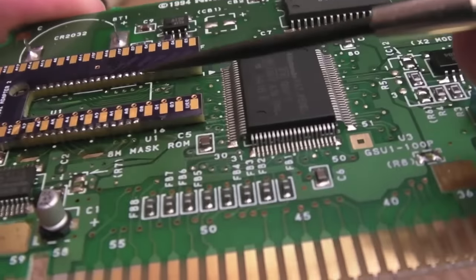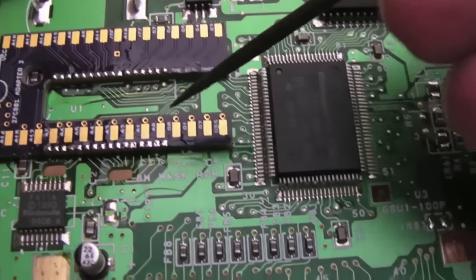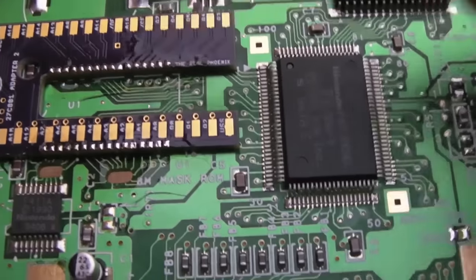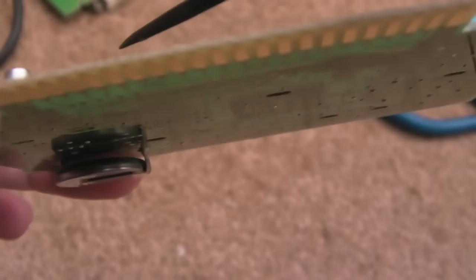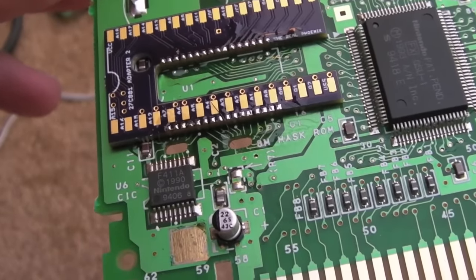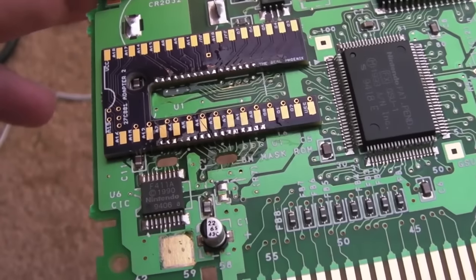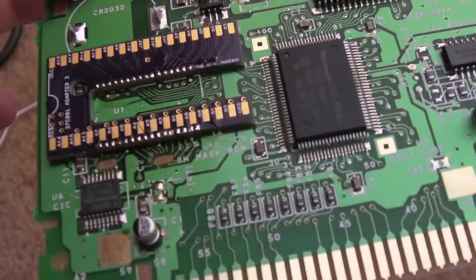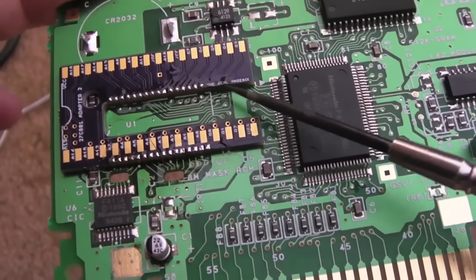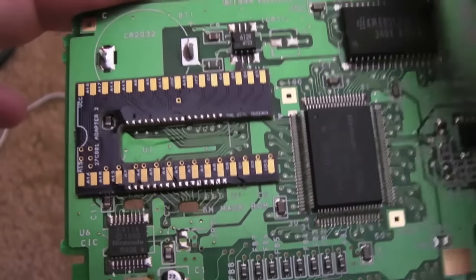What I've done is sat it on top, made sure it's totally aligned, and then used some excess solder and drag soldered very slowly over these contacts. The first few held on — I could tell it had joined underneath. I've done that on both sides to make sure it's reasonably well joined. I'm not fully convinced — you can see down here whether one or two of the pins are joined, but I'm just not sure it's completely joined. There is sufficient solder there, but it's very hard to test.